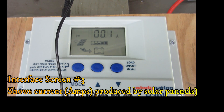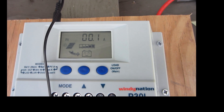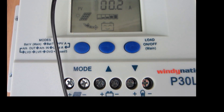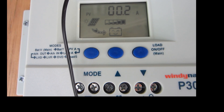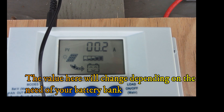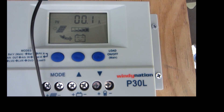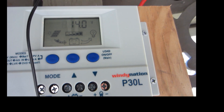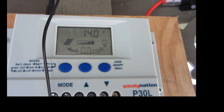Push mode again and it's the photovoltaic solar panel output current interface. It gives you the current in amps — the value displayed is the input current to the controller from the solar panels. I notice it's only putting out 0.1 amps because my battery is almost fully charged. But if I turn on my inverter that goes up, because it's drawing off the battery — so my amps go up. Each panel can put out about 5.85 amps, so it could be as much as 15 amps if the battery is low.